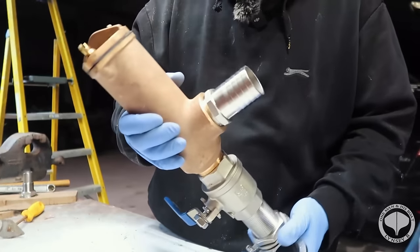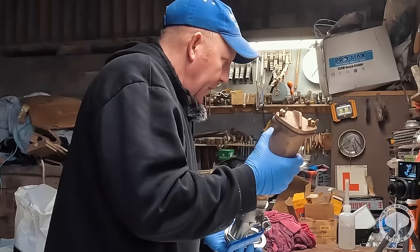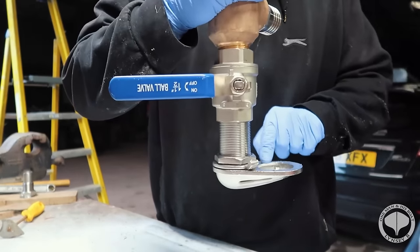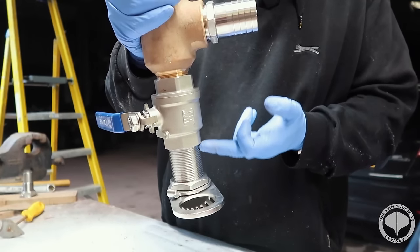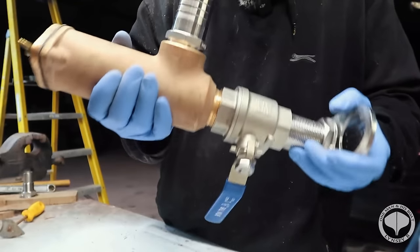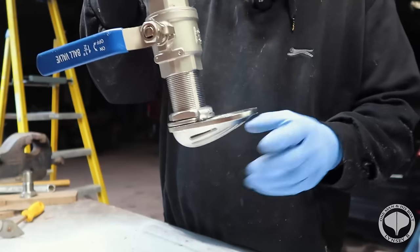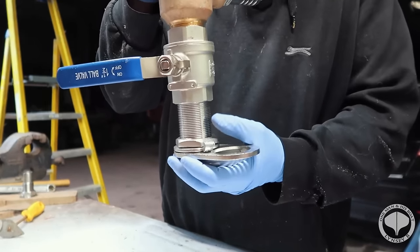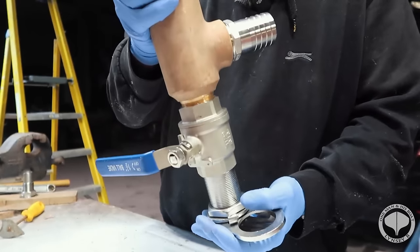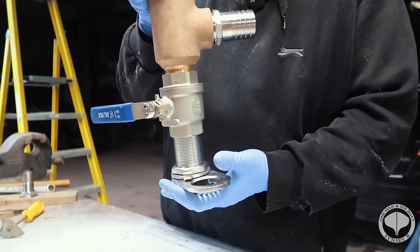So this is what it all looks like in its entirety: the scoop, the ball valve, and the strainer. Remember what I was saying about the pad on the other side of the vessel — the bottom of the boat goes onto the lip, and we need the pad in this area to stop the pendulum effect. The weight of this assembly is considerable — if someone accidentally falls on it, with just the nut on the hull it's going to make a massive hole. The more we can do to support that weight, the better. Plus it's an MCA requirement — you must have a big pad on the back, and that's exactly what we're making next.